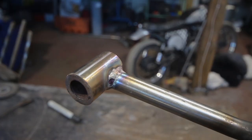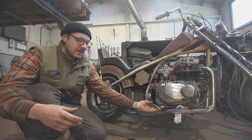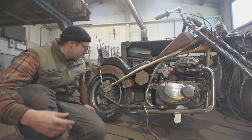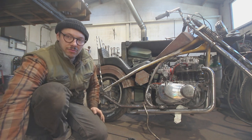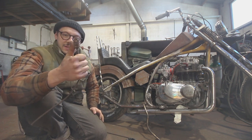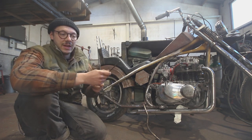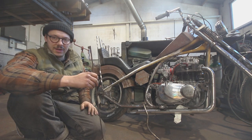I've finished up my welding on there and that's come out pretty smart — I'm rather pleased with that. What's more is it fits on very nicely and roots itself well. So the next thing I need to do is find a way of connecting the action of the brake pedal to the drum brake. Usually that would be done by a 6mm bit of rod, but we're not going to use that. What I can do is take this fitting off, take off some of the components from the old drum, put a little thread on here so that I can start fitting some of those components and thread it through the back there.